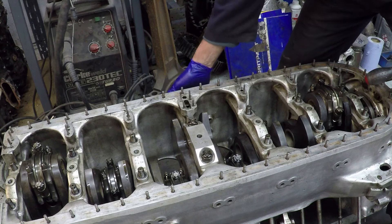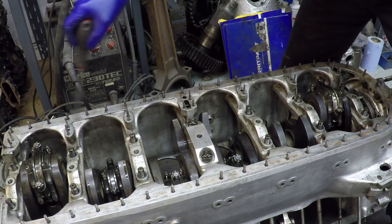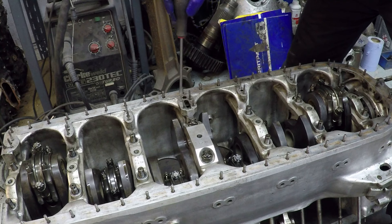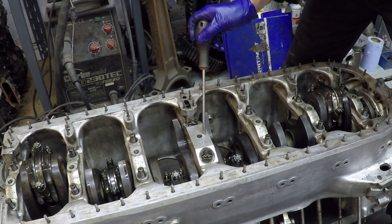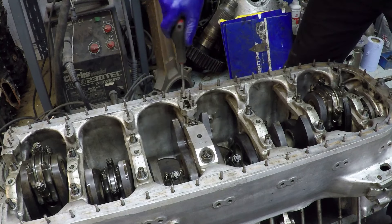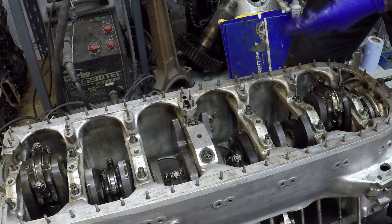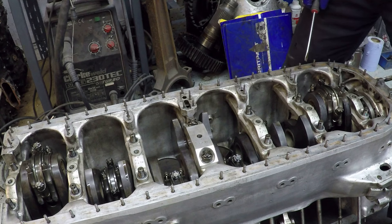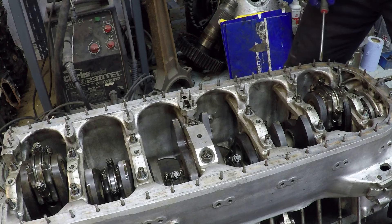One more thing — this feature here, the oil pressure relief valve, is fitted on the side of the crankcase. These three holes feed oil into a gallery that runs along here. The main oil pressure comes up into the gallery, back down into the front hole on this one, out through into the bearing cap and into the shells, and the same with all of them. This is the overflow from the oil pressure relief valve, so particularly when the engine's cold — with SAE 50 or Aero Shell 100 oil used in these — the oil pressure can go really high and that will definitely open. This just dumps oil straight down into the large crankcase where it's picked up by the scavenge pumps.